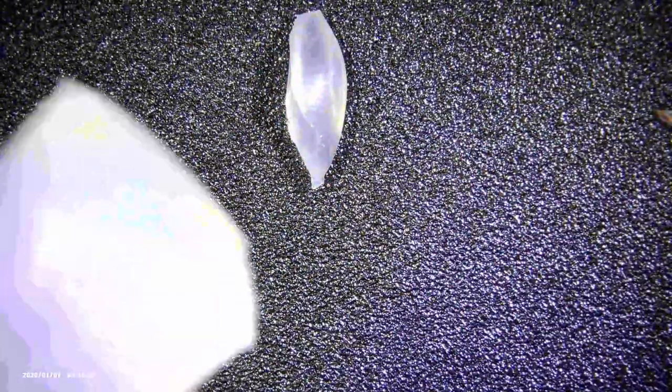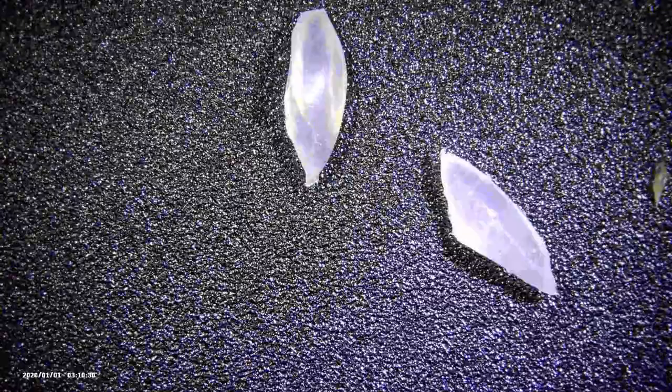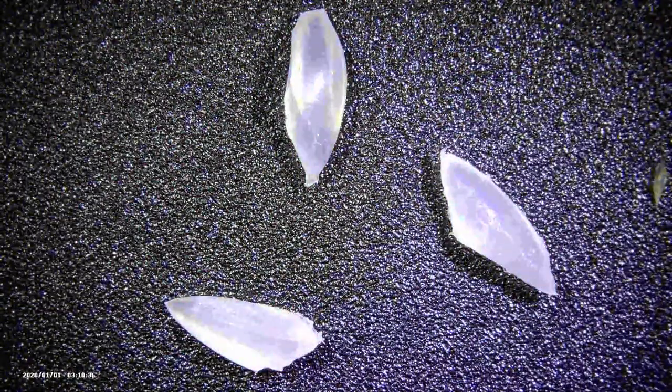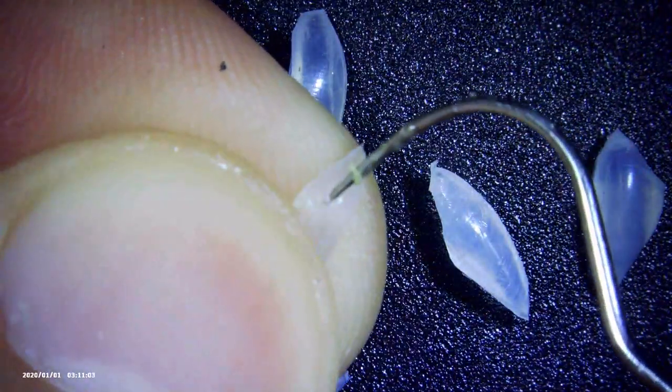You've got to glue them. Take your glue and chip off little tiny pieces — use the wire cutters to just clip off little tiny ones. We're going to stick those on the end of our dental tool. Clip like three or four of them off and have all your glue prepped before you start applying it, because you want the connector to remain hot and uniformly hot. Keep all your supplies laid out because when you start this process, you've got to do it all at the same time.